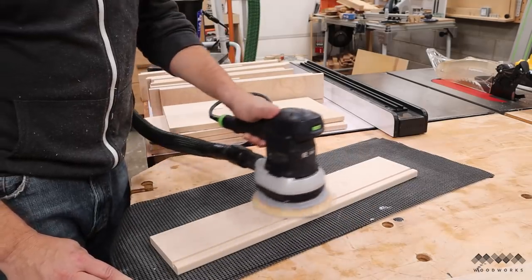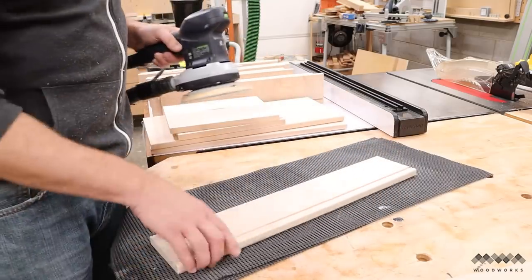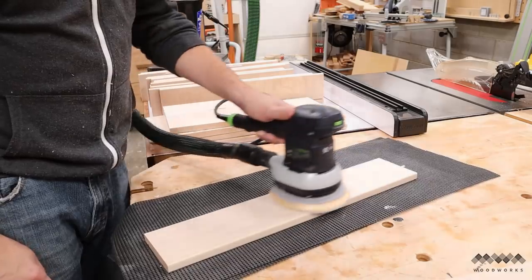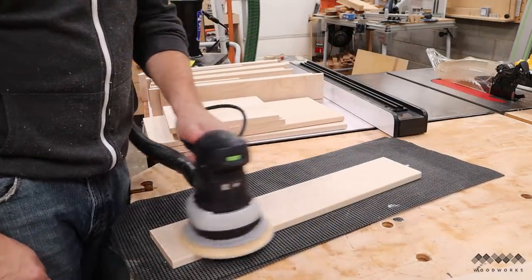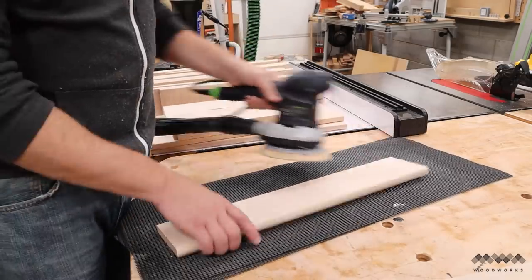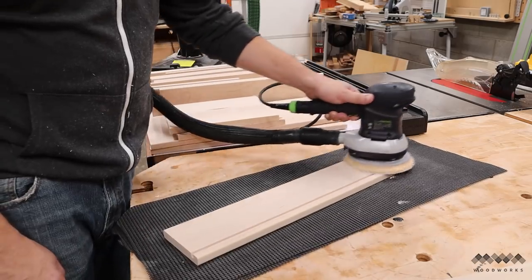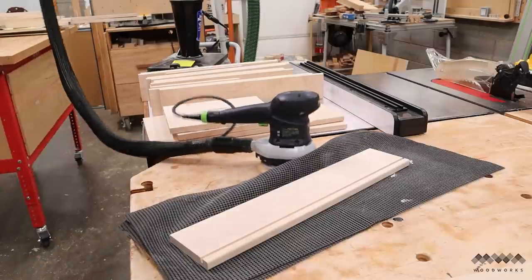Because I'm going to be spraying a clear coat on these drawer parts using my HVLP system, I didn't film it — I really don't have a good way to protect my camera equipment yet while doing this kind of work. But I am putting an interior water-based polyurethane on these drawer parts. I use water-based polyurethane here because the oil-based ones tend to yellow maple, and I really want to keep that nice, bright, natural look to it.